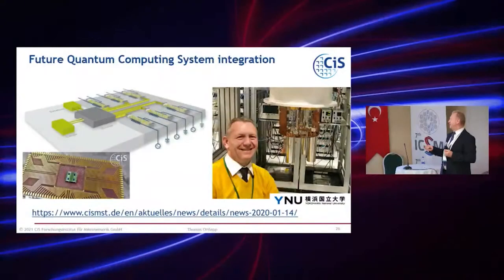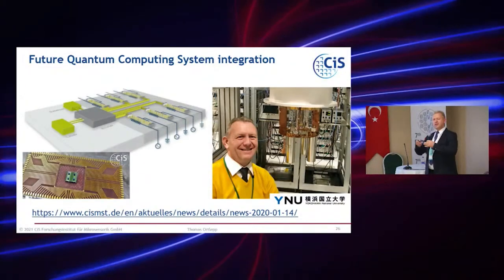It's not yet finished, but our idea is to move from these approaches to something which is all very compact. It's not a single die, but it's a very hybrid system from 4 or 5 different technologies, but at the end of a cubic centimeter size, with 64 optical fibers, with a lot of electrical connections. A lot means maybe 20 DC and 4 AC, because we use a big CMOS decoder and serial to parallel converter. Otherwise, you don't bring the data.